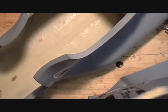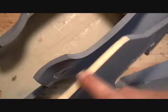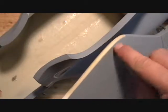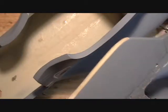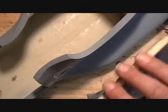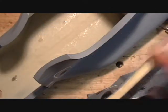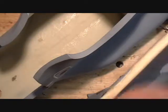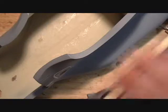and I've asked him to make this change. But one thing I've noticed is that this body in this front area is too tall, so you've got to come in here and knock off a good 3 millimeters all throughout this area. When you do this, it'll make this front canopy and over wing fairing fit much better. I just sand it off 3-4 millimeters, and then I just fill it back full of epoxy.